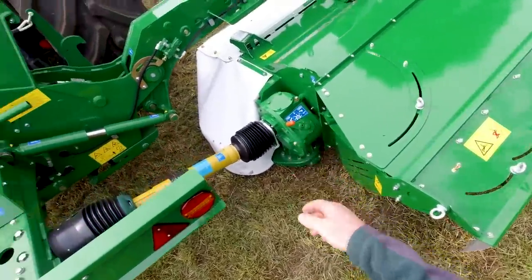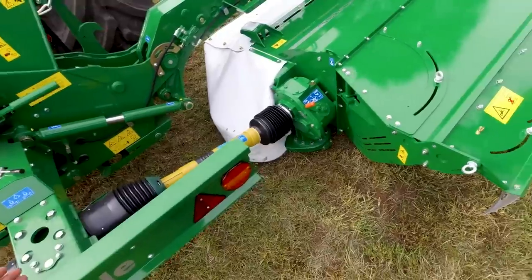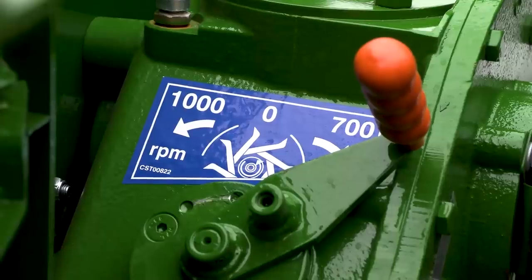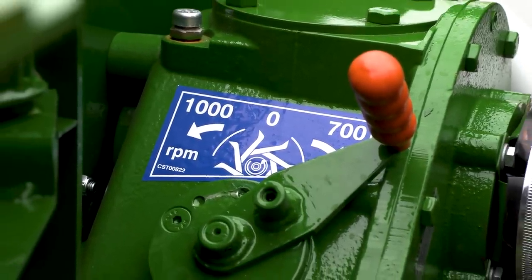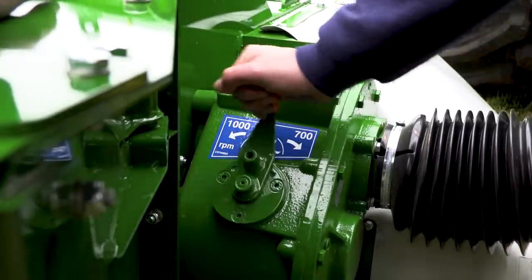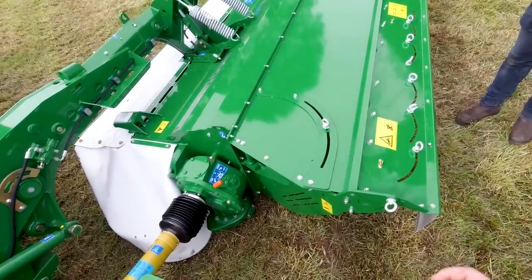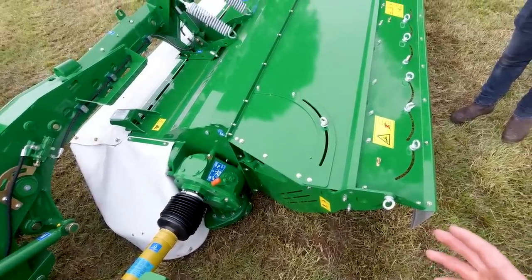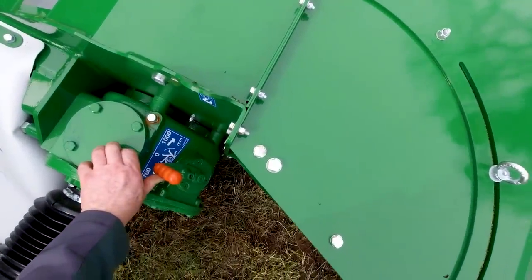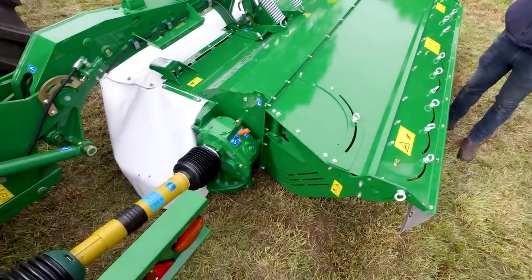The gearbox itself — looking from the drive line, you've got 1000 RPM coming from the back of your tractor through a star profile heavy-duty shaft, down into the gearbox. All McHale mowers are gearbox drive; there is no chain or belt. On the conditioner you've got two speeds: maximum speed of 1000 RPM which kicks the grass up on a heavy crop, or you can slow it down to 700 RPM for a lighter crop to leave a more uniform conditioned row, or if you're doing whole crop or clover, it's less aggressive on the material. You can also turn the conditioner off by moving the sector lever to the middle — a useful feature for cleaning up a field after cattle.